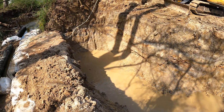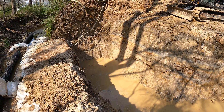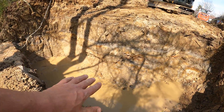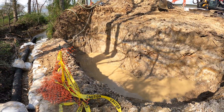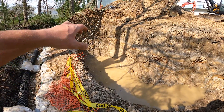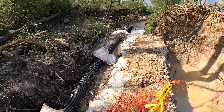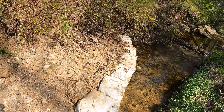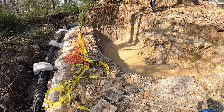What we're getting ready to do is drop the pump into the hole we dug, pump this out, then get the laser level out and check the depth. I know we'll have to clean up a little bit along this side, but through here we should be pretty close. Then the plan is — I've got a bunch of rip rock, which is larger aggregate, about one and a half to two and a half inches. We're going to put a layer of that in and leave a small pump running in a pit to keep the water out. We also did some adjustments with the creek — got a culvert pipe in, so we should get a lot less water running into our trench. We'll get our rock in there, get our depth right, and we'll be ready for concrete tomorrow.